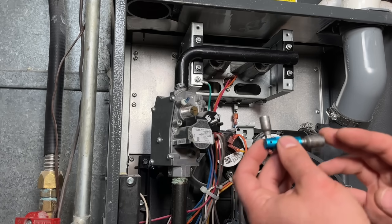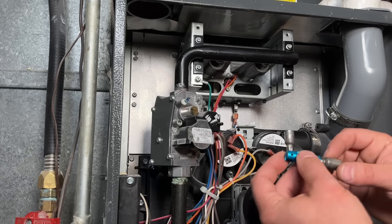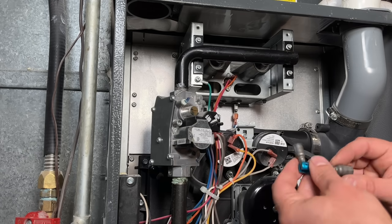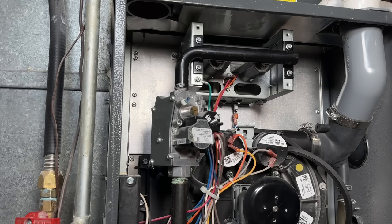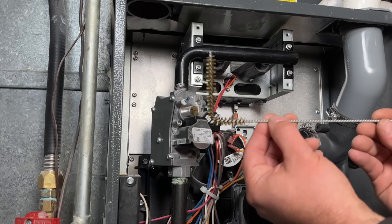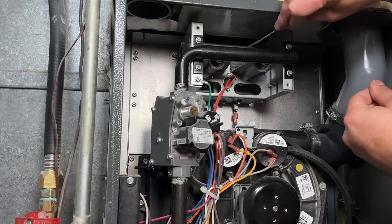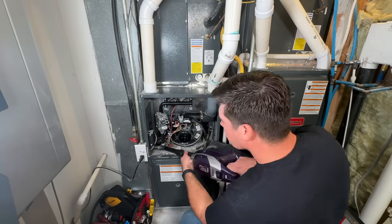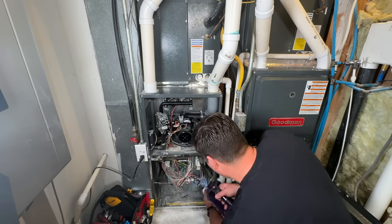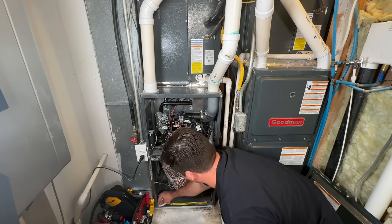There are a lot of different specialty tools you can use for the flame sensor. This one is in a tighter area and harder to get to, so be very cautious with raw edges — I actually cut myself on this furnace. If you don't have access to a tool to reach the flame sensor, another option is a simple pipe brush — these will be in the description below. Just feed it through, working it up and down on the flame sensor. The last part of step three is general cleaning: take a vacuum cleaner and clean out the inside of the cabinet, wipe it down with a wet rag, and use a can of compressed air to spray off the circuit board.